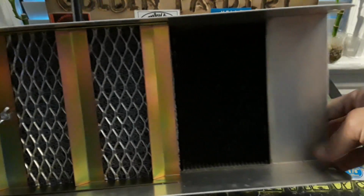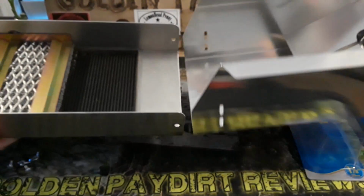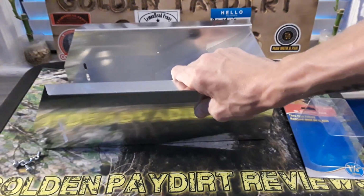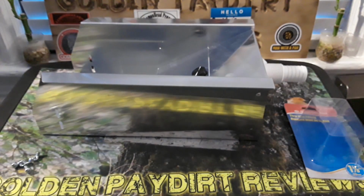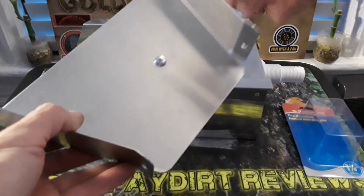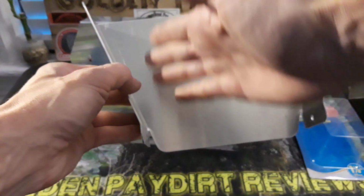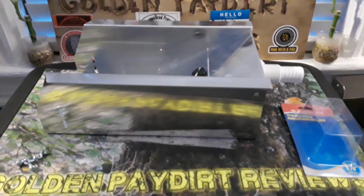What you do here is right here in the front of the sluice, you would take the header box and attach it on just like this. And the water would run down and act like you're in a stream. So that's pretty cool. Instead of putting the flare on, now the flare, which goes in front of a sluice, basically is for a river, which channels the river or the stream into the sluice to clean out the material. And that's the reason it's shaped like a V. So the water pressure gets smaller, wider on top, smaller, so it creates pressure to clean the material down the sluice.